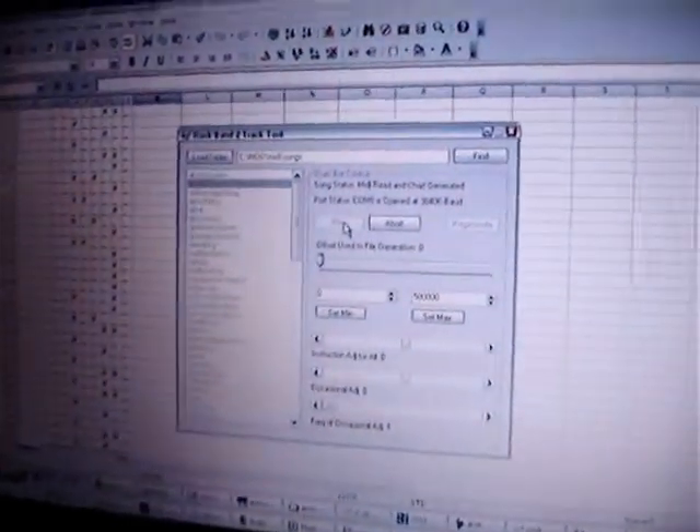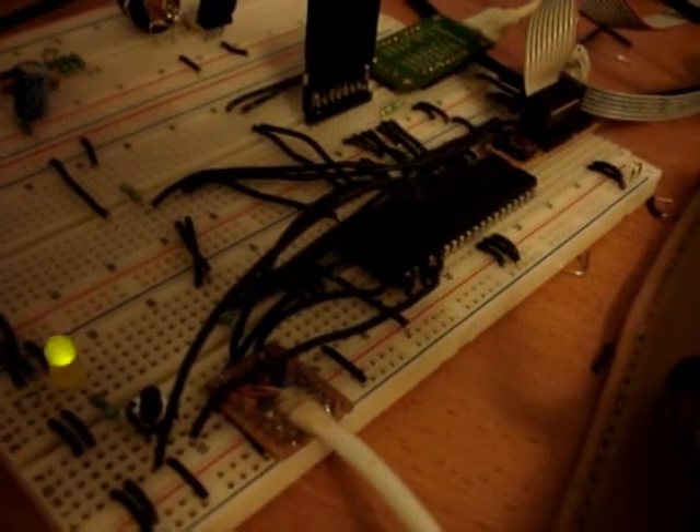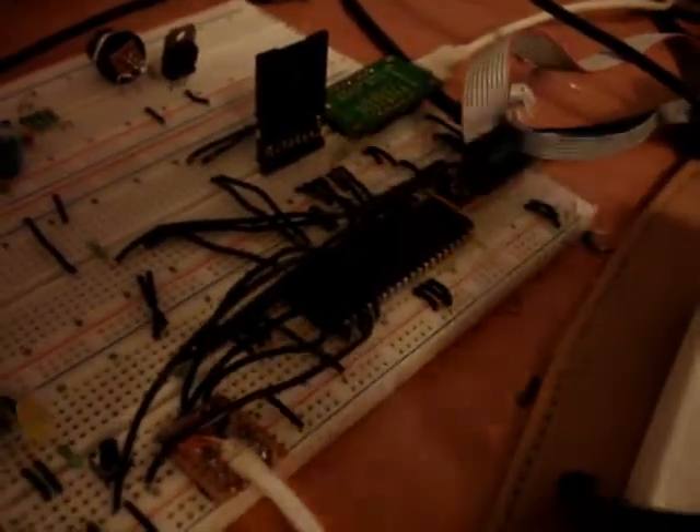It's built on an AVR microcontroller connected to my Wiimote, and my Nintendo Wii is running the Rock Band 2 game. I have extracted all the MIDI files and my program here will extract the note chart from the MIDI file, generate a list of instructions and send it to the instruction buffer on the AVR chip. The AVR chip will execute each instruction with the appropriate delay associated with the instruction, and that's how it plays.